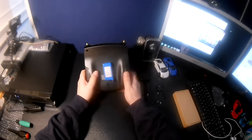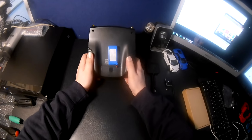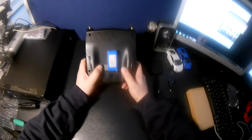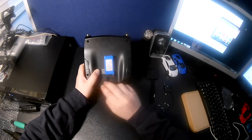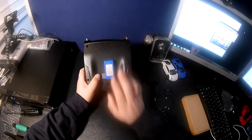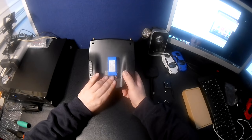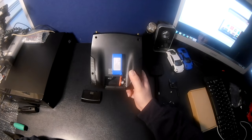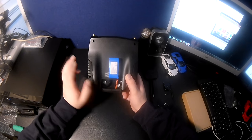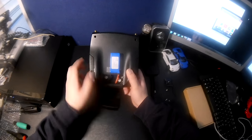The second mod is the LiPo battery. You'll see many other videos where people have gone to quite deep extents to convert the transmitter to LiPo power, because as many of you probably know, the H501S transmitter comes with a battery bay for four AA batteries. Those batteries get drained very quickly - I'd say four AAs give you two flights maximum and they're nearly dead, so you probably couldn't even manage a third flight.